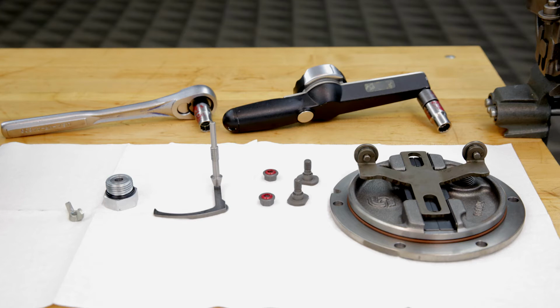Before performing this service, ensure that oil has been drained from the pump and remove the fitting or plug installed into the drain port on the side cover. Also, reduce the risk of introducing contamination into the pump by spraying the wishbone and the wishbone locating plug with brake cleaner or equivalent and wipe down dry. The pump should also be thoroughly rinsed off.